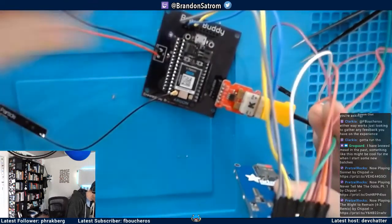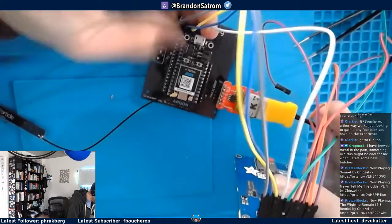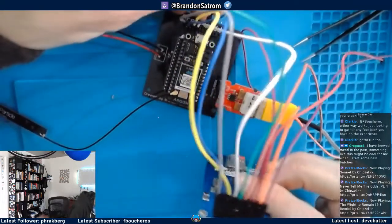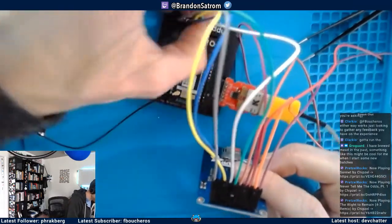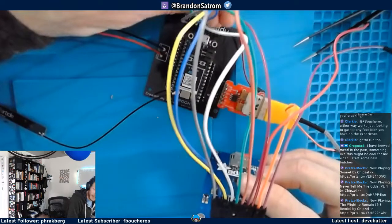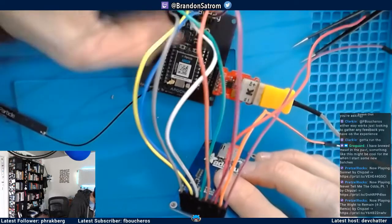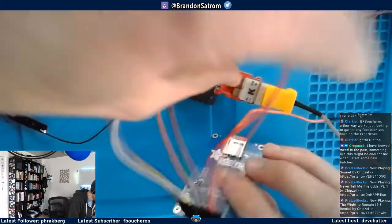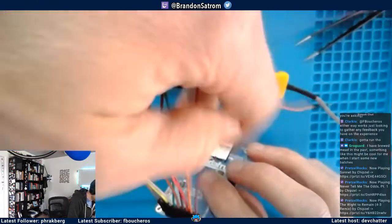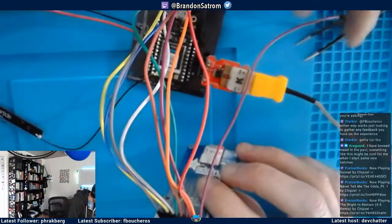See, I wanted a ribbon cable because to keep this PCB small, I had everything relatively close together. I could have rotated the display, maybe. This is more fun, in a manner of speaking. So the ribbon cable will help me keep it connected without being constrained by where the microcontroller is and all that good stuff. You'll also notice that I am now blocking the USB port, but not to worry, because that's why we have a LiPo connector on these now.